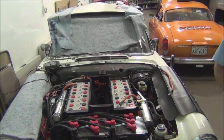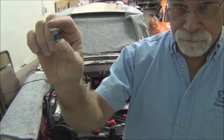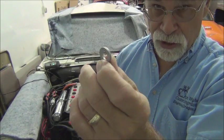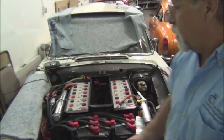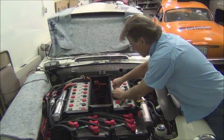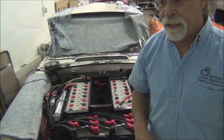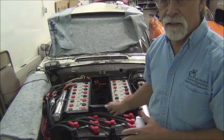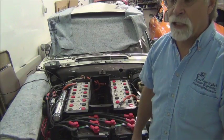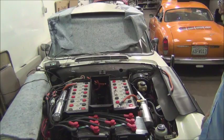The interconnects are held in place with a bolt — we use bolts with Loctite on them and then a Nordlock washer. If you want information on those, check them out online: Nordlock, N-O-R-D. This makes a really solid attachment setup. We inspect our shop vehicle — it averages 50-plus miles a day — and we check it twice a year every six months. We find the system holds; we could probably do it annually and not have an issue. We don't find any loose connections. This really seems to do the trick.